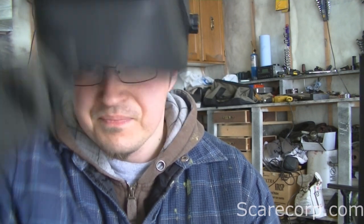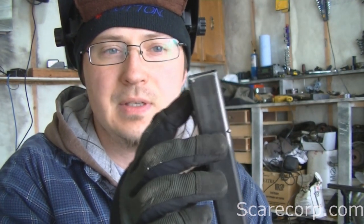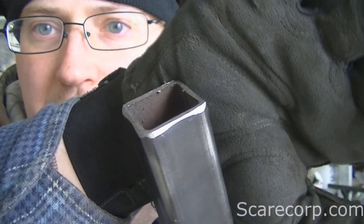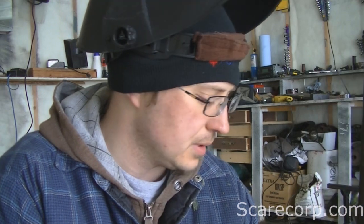You want to have a good mask — something auto-tinting if you can afford it. I just have a little flip-up one and it does pretty good. For gloves, you want to wear leather; you don't have to get the really big thick ones for hobby welding. For your steel, you want to clean the edges where you're going to be welding — just wire brush the ends. What I actually do is grind all around the steel at about a 45-degree angle. That helps the bead stick in and adhere better, especially with a lower amp arc welder.